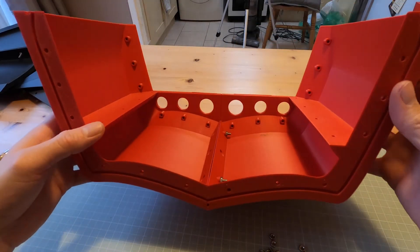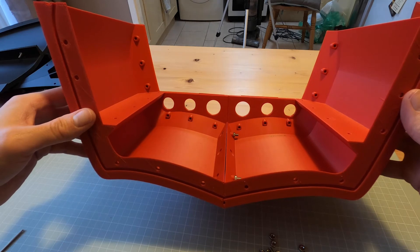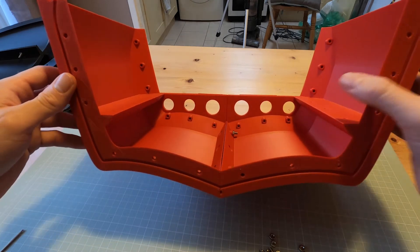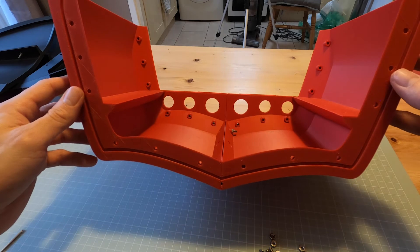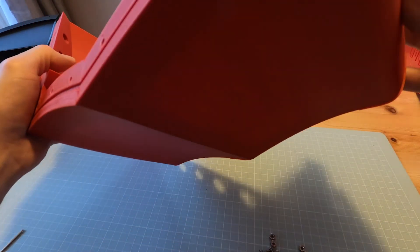What I will say about the design is we've designed it so we can take it apart, print off new pieces and stick it back together — keeping it waterproof without gluing it. This is why you see these channels here: we can stick O-ring cord in them and it will compress against the other piece and create a waterproof seal. Or at least that's the theory.